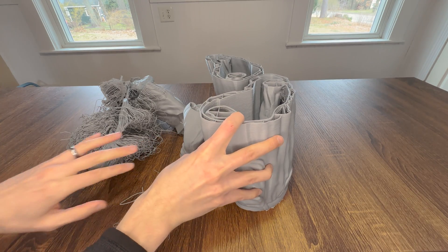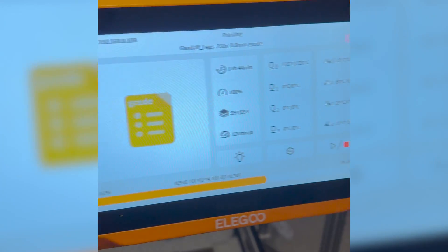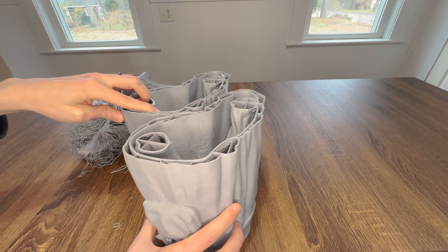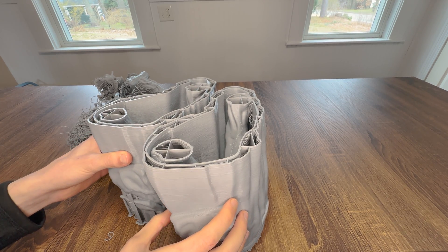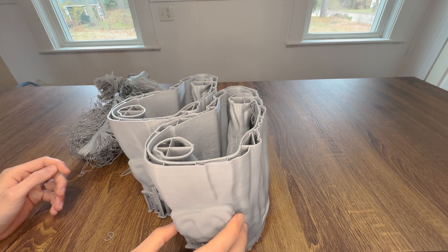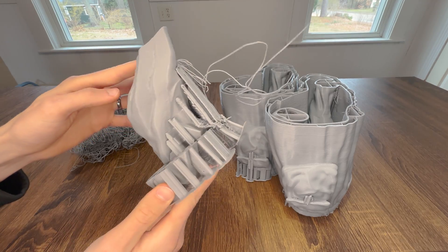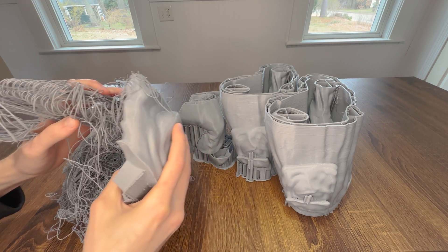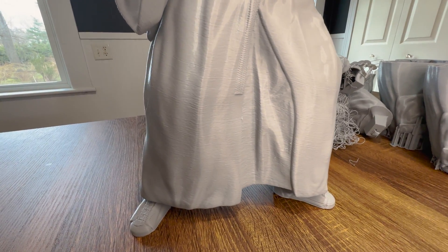The first problem was with his legs. When these were printing, the printer stopped at a certain layer and paused, and no matter what I did, I couldn't get it to resume. I tried again and the exact same thing happened — it got to a certain layer and completely stopped. I solved this by re-slicing the files and putting them on a fresh USB, after which the print worked successfully. This leads me to believe the USB got corrupted. I also saw a layer shift, which was also fixed by formatting the USB. Then there was a different kind of layer shift where the bottom of the print detached from the build plate and started sliding around — a mechanical layer shift as opposed to a software one.